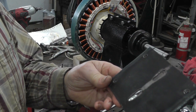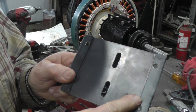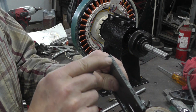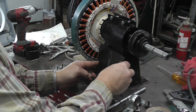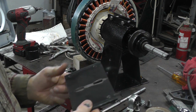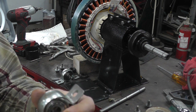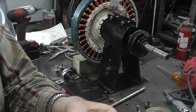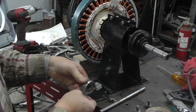I made this plate that's going to go on here. What I did was I took a piece of eighth inch and I welded it on both sides. It fits on there like that, and I can slide it up and down using these grooves — that'll be to tighten the belt. And I've got some ball bearing pillow blocks, this type. Hopefully they're going to be heavy duty enough.